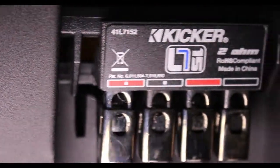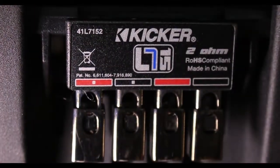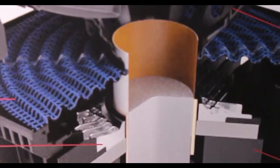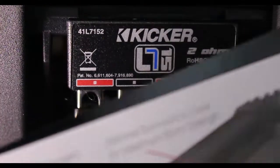That actually creates additional cooling for the voice coil, and air of course obviously pumps out of these vents here - we got them on all four corners, including the corner with the terminal. I'll show you the exploded diagram picture so you can see better how that works. There's an aluminum piece attached to the voice coil former so that way it'll handle additional power and additional abuse. There is no doubt in my mind that this sub is going to handle every bit of the 1200 watts RMS.